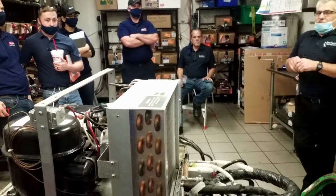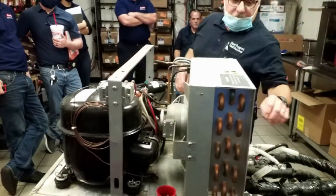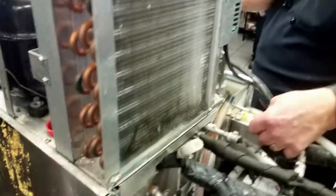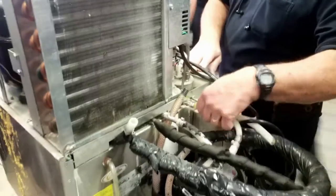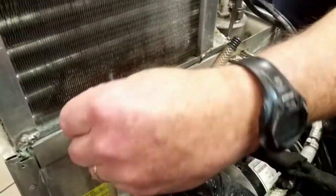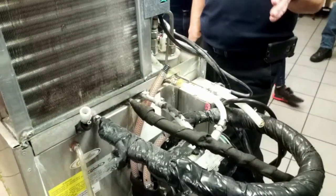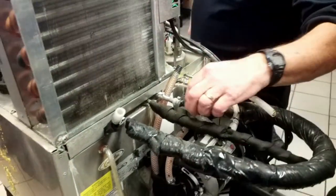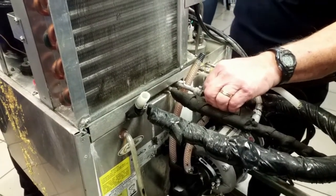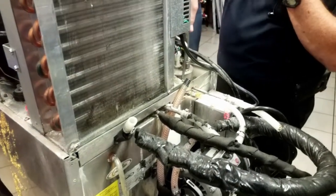There's three coils inside that water bath. We have plain water comes in, and there's a little coil right up front here that sits down in here, and it comes back out. So it kind of pre-chills the plain water. The water line comes in, goes onto the pump, out of the pump, into another coil, and then into the tank.